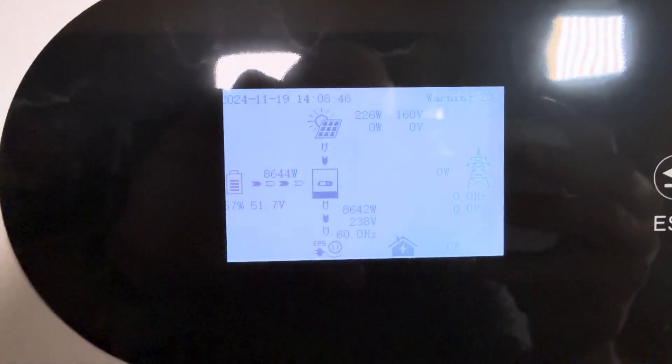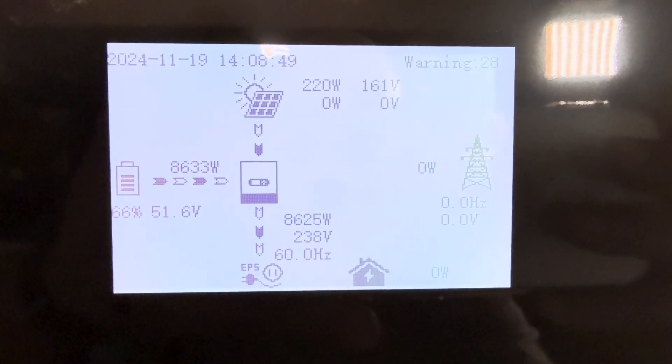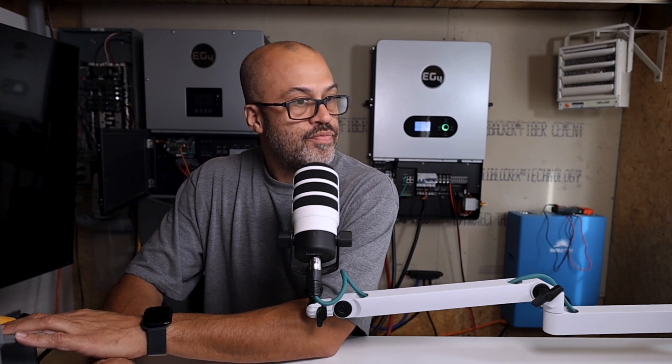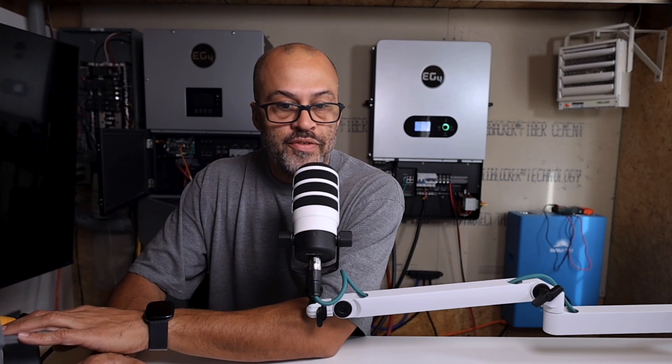Let's try it again — and remember, we're doing this all off one battery, which is why we're getting that alarm. You need 400 amp hours to get the full rate of the inverter. Got it going again — 8620 watts and a notice right now. We're seeing 151 amps. Turning one heat gun off — now at 123 amps and it's back to normal. So it looks like when it goes above 150 amps you get a notice, but it doesn't kick out.